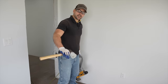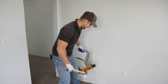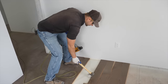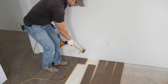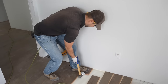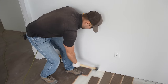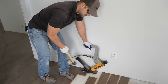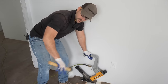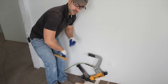After the rows are laid out ahead of time, here's how to quickly install using the nailer. Take the rubber side of the hammer and pull the board down to where you want it, gap it appropriately for expansion, and tap it into place with the rubber side. Then nail it every six inches. Don't forget to wear your ear protection.